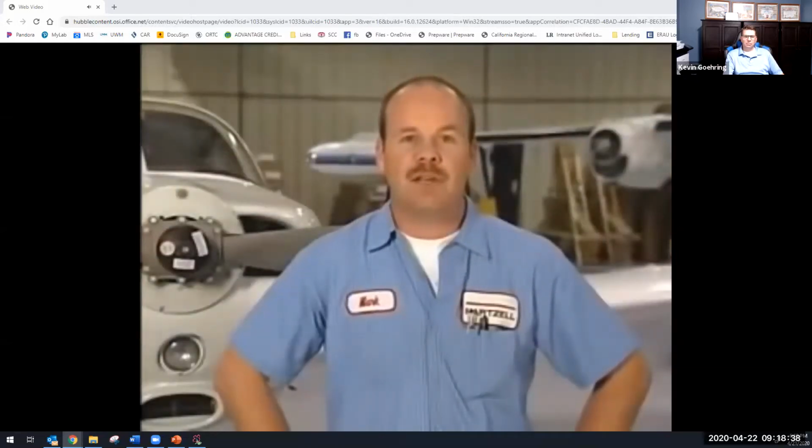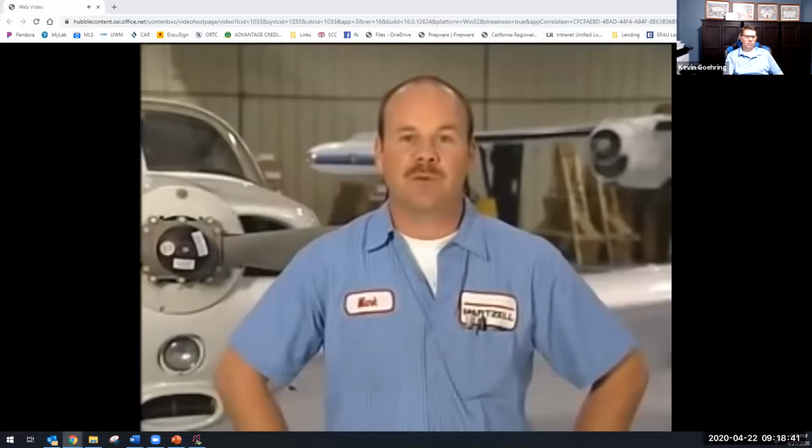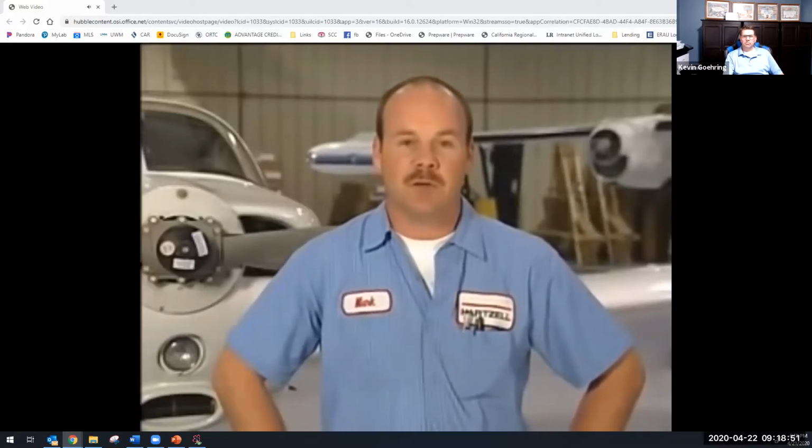An operational run-up of the engine propeller is recommended any time the propeller is removed or significant propeller maintenance is performed. But before we demonstrate the run-up, I want to mention the importance of dynamic balancing a propeller. As you know, all props are statically balanced when they are new, overhauled, or had a major repair done. Dynamic balancing balances the propeller to the engine and helps reduce vibrations that can be caused by a rotating system. Dynamic balancing can also help prolong the life of the propeller, engine, airframe, and avionics. Dynamic balancing is only recommended, not required unless specified by the airframe or engine manufacturer.